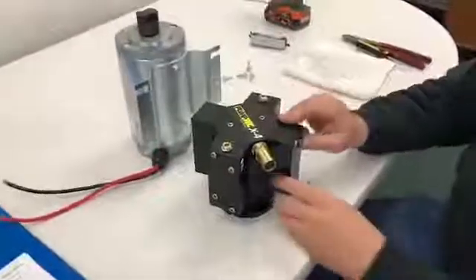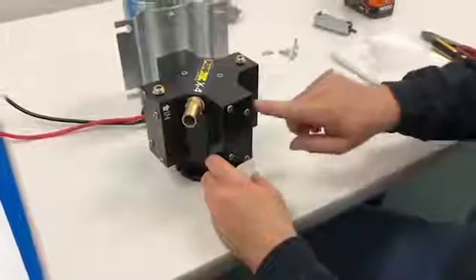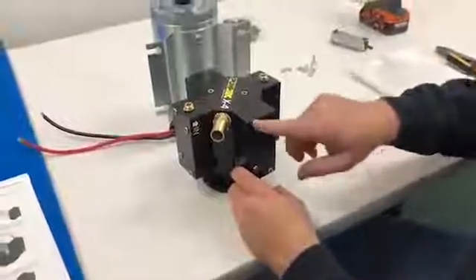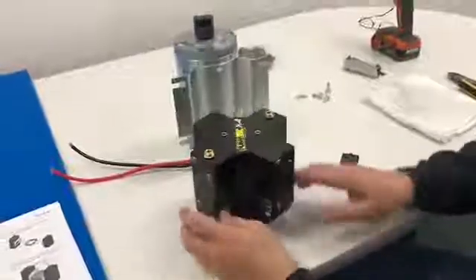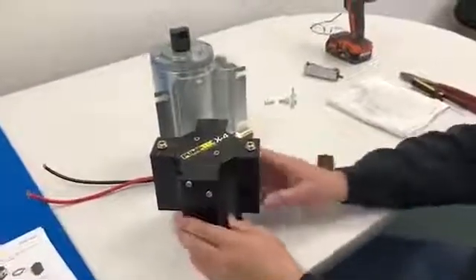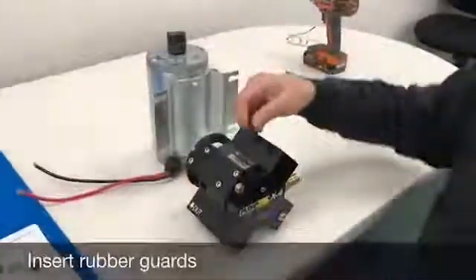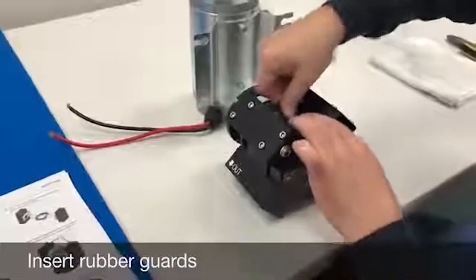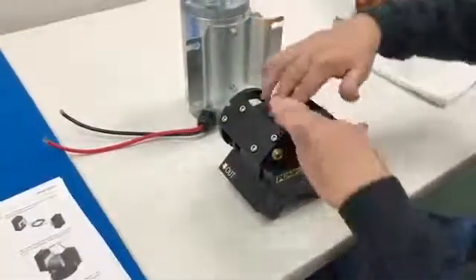Now that I've replaced all the heads on the pump and tightened all the bolts — the procedure for tightening the bolts is: start with the top left, go to the bottom right, go back up to the top right, and go to the bottom left. Tighten in that same pattern for all of them. After you've got them all tight, take your rubber covers and put them back in — these just protect the pump from rain and dirt. Push the front in and they go in pretty easily.